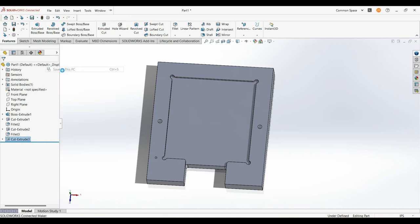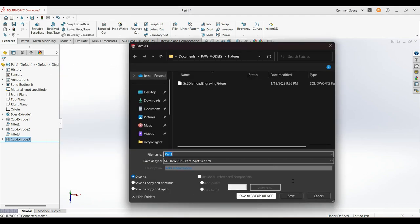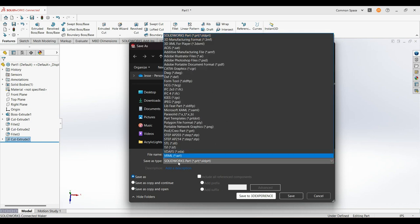I really don't like the 3D experience saving files to the cloud — I like to save locally. I'm going to save it as a SolidWorks part, but you could do an STL, a STEP file, a Parasolid XT, an IGES — any of those will work. I can just import SolidWorks directly into Fusion, which is super cool; you don't need to do a lot.